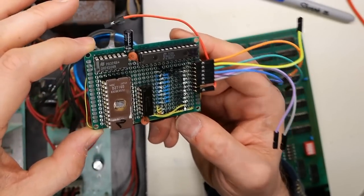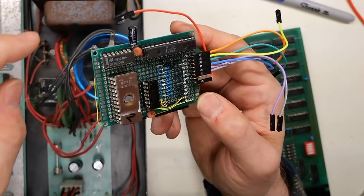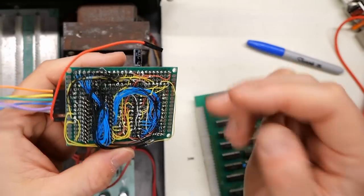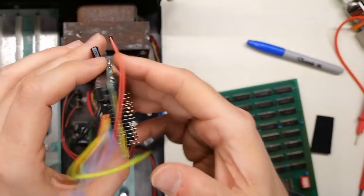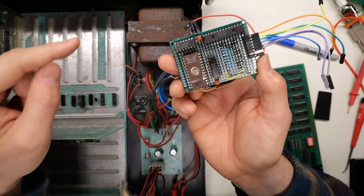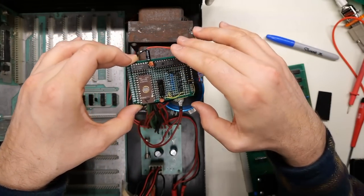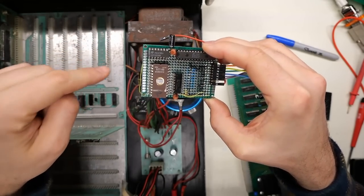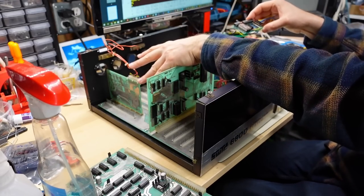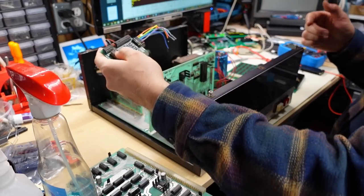This is the Adrian Black special edition homebrew RAM expansion board with a ROM expansion for the Southwest Technical Products Corporation 6800 computer system. I decided to hand-wire it all. I knew I needed to replace the ROM on the CPU card with the newer SWTBUG instead of the original Motorola MICBUG, because SWTBUG has a lot of extra and better features. One of the big ones is that SWTBUG supports not only this 300 bits per second bit-bang card, but the serial card as well.